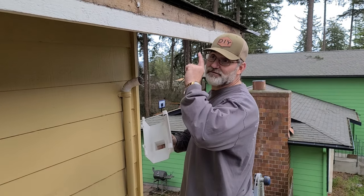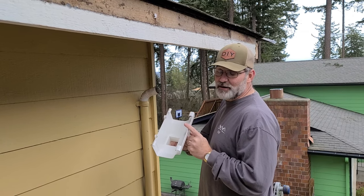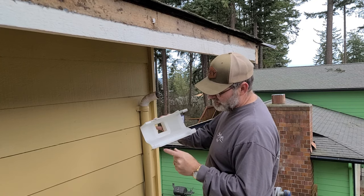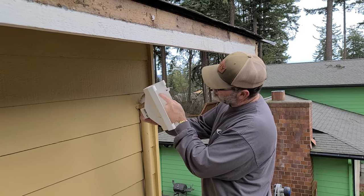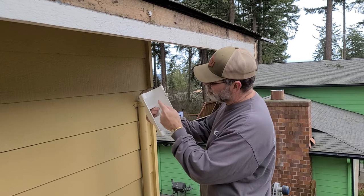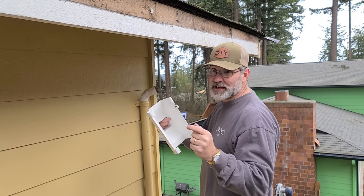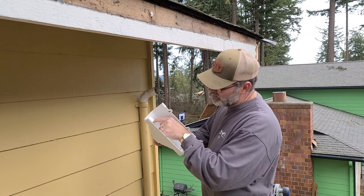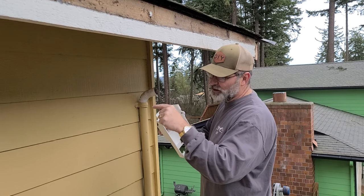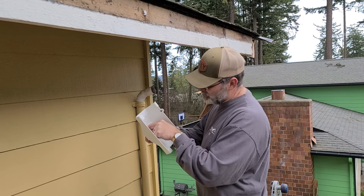Because we have less than 10 feet now, I put in the downspout cradle, and that gives me a way to measure from the end of the last gutter section to the cradle. In the cradle there are little hash marks — they're temperature-associated. You have to measure from the end of the last gutter to the mark based on the current ambient temperature that day. For example, on a really hot day the plastic expands, and then that winter it contracts and could pull out and fall. So on a cold day you want it closer to the end; on a warm day it moves inward.